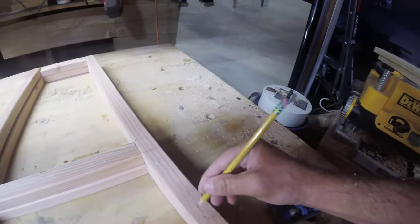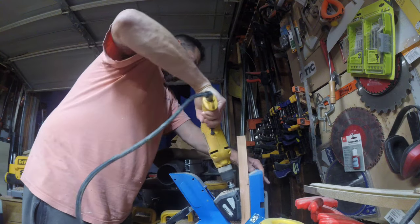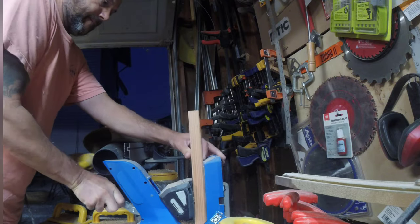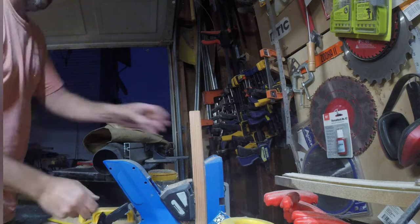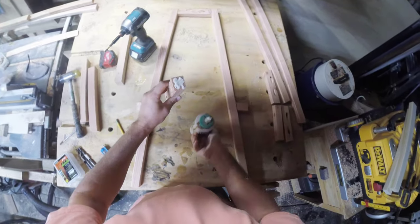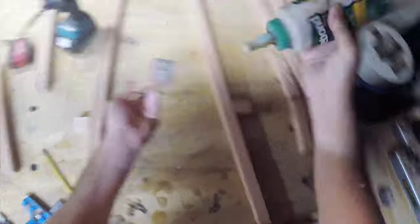For any project I like to lay everything out and mark everything with pencil that we're going to sand off later — that's why I do a very rough sanding to start. For the wider planter we're going to use pocket holes, one pocket hole per joint, and then we're also going to use some glue and throw some trim head screws in later, especially on the bottom braces for holding the shelves and also the top long braces. So we're going to use trim head screws, glue, and pocket screws for this joinery.